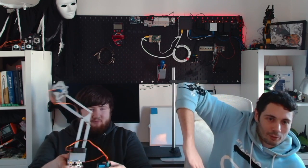And it should be reasonably challenging but still achievable because it's planar and with only 2 joints. It means that we can start with this system and then mount that upside down on a sliding rail, giving it more versatility to move in 3-dimensional or Cartesian space.